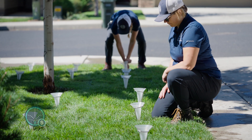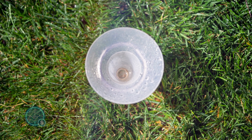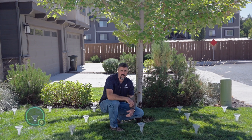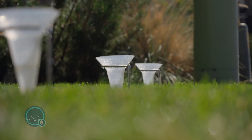In order to find out your sprinkler efficiency, you can run a two-minute test and check each zone for issues that may affect the delivery of water evenly across the landscape. Now we've finished our catch can test with our standard spray nozzles. Let's take a look at the results. This test is going to tell us how even our sprinkler coverage is, and also the rate at which they apply water, which is going to help us when setting our run times later.